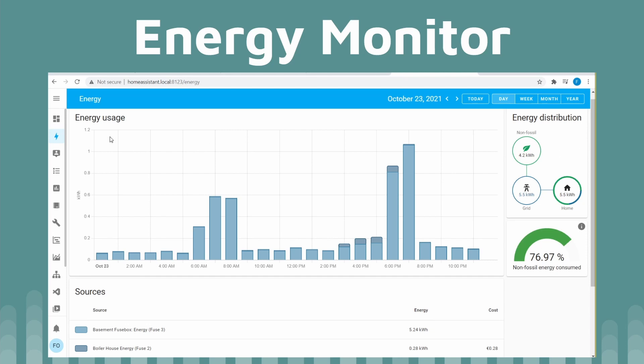Lastly, there's a new feature that Home Assistant recently added: the Energy usage tab. This is all pre-configured — you add your devices to it and it outputs a lot of interesting, very readable information. It also adds extra features such as estimating fossil fuel versus non-fossil fuel usage based on your location. It's designed to work with solar panels too, so if you introduce solar panels you get very deep insight into how much power you're using versus drawing from the grid. It's free, comes with Home Assistant, and the PZEM devices are detected natively.